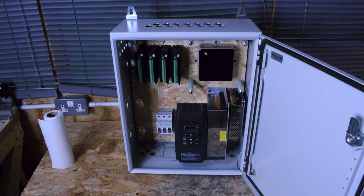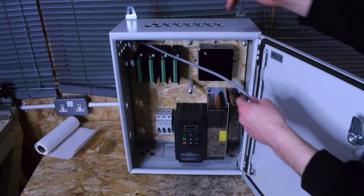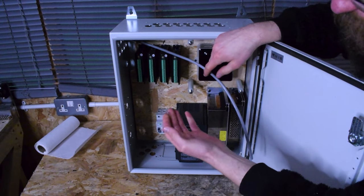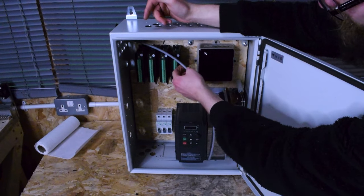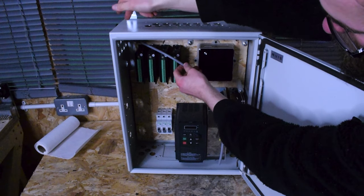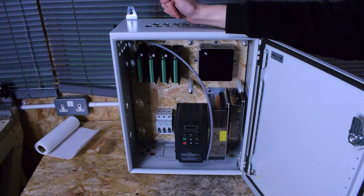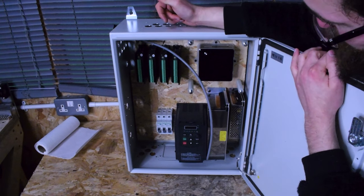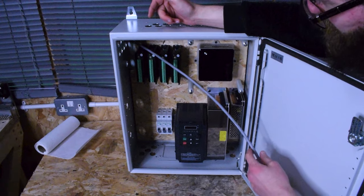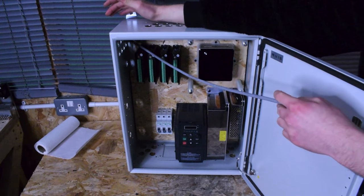From there, I'm going to be placing these cables through. Basically I have a lot more cable than I need, but it's going to be really neat. Each one of these cables is going to go to a different driver, and I just need to mark out where it needs to be cut so they can really neatly come straight in and be mounted to these blocks. The great thing about these is they come out — so I can go and connect them up over on the bench, make sure they're nice and secure, come back, pop them in, and it's happy days. You can see now why having the quick disconnects is a massive advantage. If I ever need to disconnect the machine from the box, all this stuff is never going to have to change.